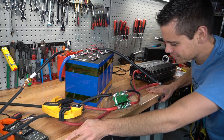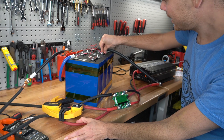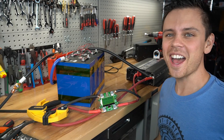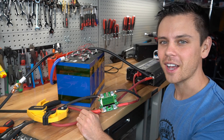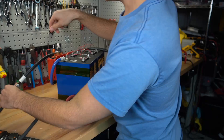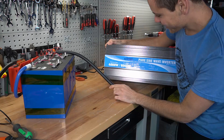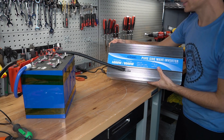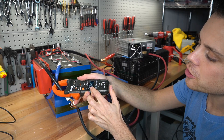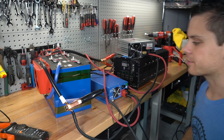I'm usually not prepared for when grade B cells actually pass the capacity test. So we actually have a battery — let's test it. Let's charge it up quickly and do a fast discharge. You're in for a special treat because I bought a 4,000 watt 12 volt pure sine wave inverter just for this test. Right now we're charging at 134 amps — I'll come back in a couple hours and then we'll hook up the inverter.